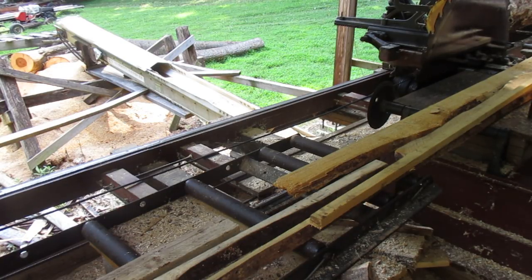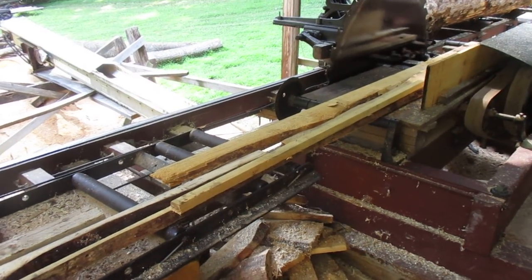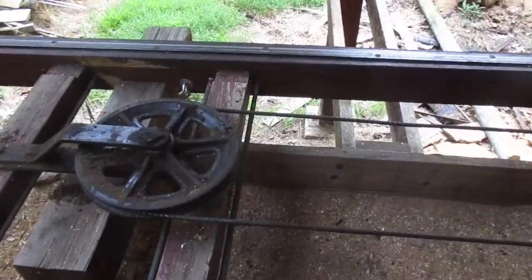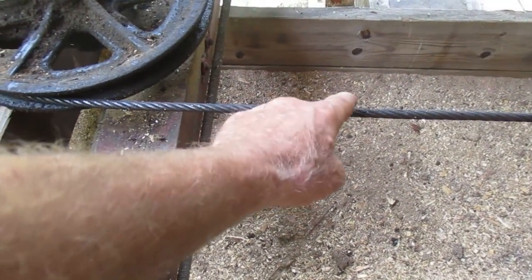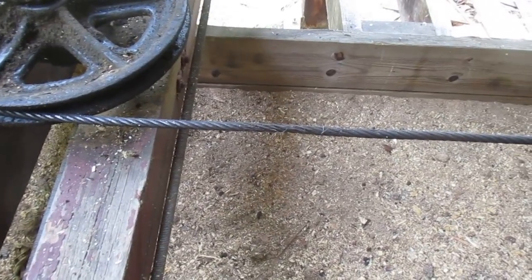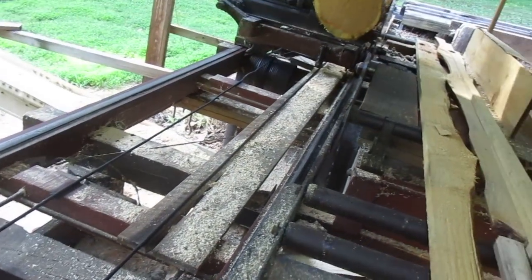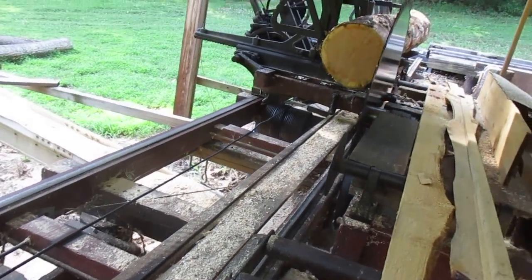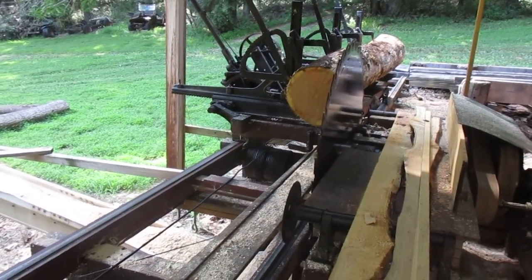So I went down it with a rag, all the way down and up, looking for a little defect. And I did find one little defect — I don't know if it's even big enough you can see — right here, there's a few little frays in it. So that means it's giving up the ghost right there, and I think it warrants a new one before I saw any more. The one thing that would be a major catastrophe is if that cable snapped off and got into that blade at the RPMs it was at.